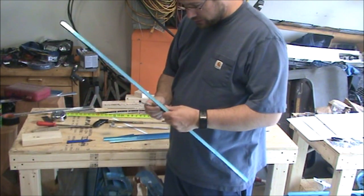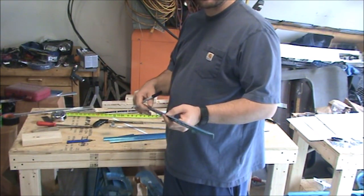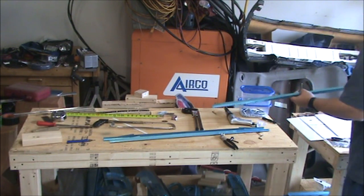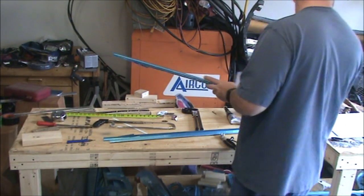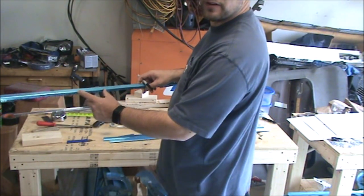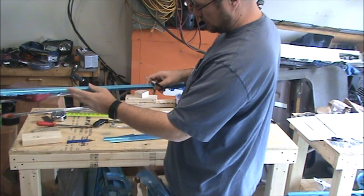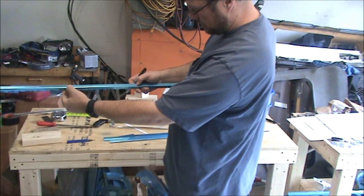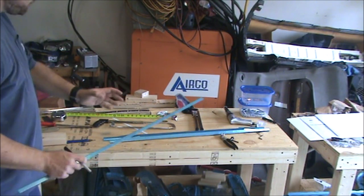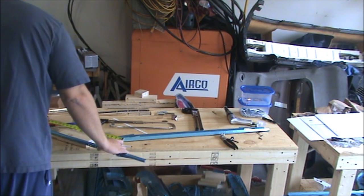As I said, as you cut these, the first ones start out pretty long and then they'll get shorter and shorter. And part of that is you have to pay attention to what lines or what holes the measurements are coming off of. It looks like basically every one that you do, you're going to step out a hole. So this time we're measuring 1/4 inch off the end of these holes. Next time it'll be 1/4 inch off of these holes. And then the time after that is too wide for my fingers to touch at the same time. It will be 1/4 inch in from these holes. But I would still look at each one and tick it off as you're going down the list.